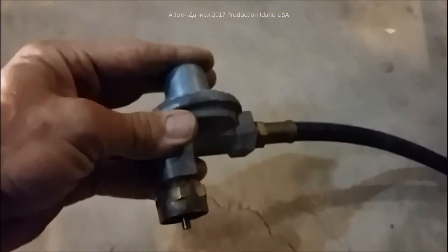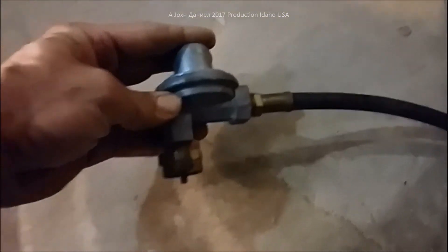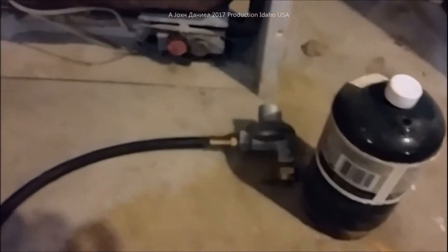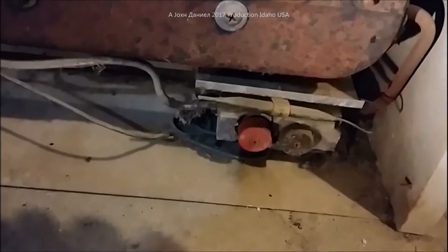It's a regulator that fits on top of the standard one-pound cylinders, so I can carry it around with me. I hook it up with a common 3/8 fitting to these furnaces and test them out. This furnace has a snap-acting valve on it - it's a hydraulic snap-acting valve.